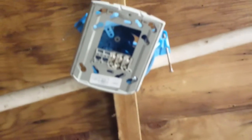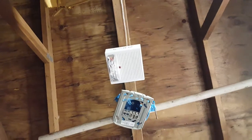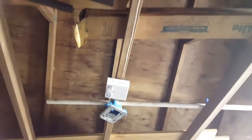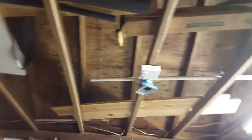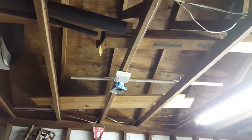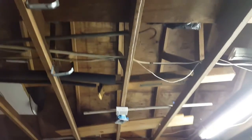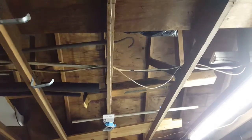We have my System Sensor SCR, but it's not there. Instead I decided to mount my Wheelock AS-24WFW. If you guys didn't know, for the volume jumper — if you remove it, it becomes a strobe. I know it's not a System Sensor device, but I decided to switch things up for a test. I think it's still set on 110 candela from the last test.